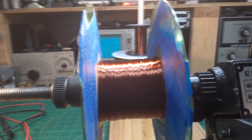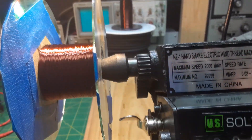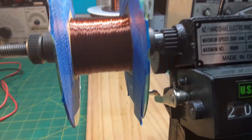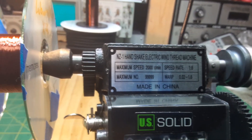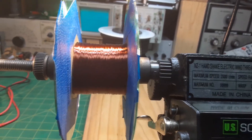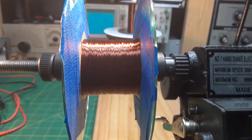Once I get it finished rolling — I don't have much more to go, maybe another couple thousand turns — I can untape it, take the original off, and I'll show that. Then we'll put it back in the speaker and see if we can get this radio to work when we recap it correctly. I repaired it in two places, tested the resistance, and I had about 1,028 ohms. It was supposed to be around 1,080 ohms, so I might add some more magnet wire to bring it up to 1,080 or even 1,100 ohms. Since voltage is higher today, I could add a few more turns to help drop that voltage a bit.